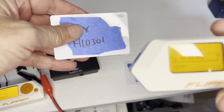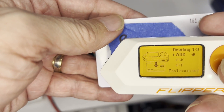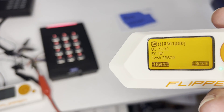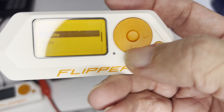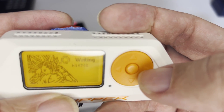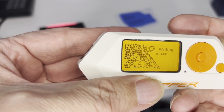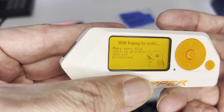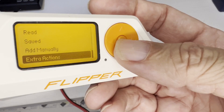Next, I'll use card 29650. We'll read that with our Flipper, and then we'll try to use our Flipper to write it to our T5577. It says make sure the card is writable and not protected. The writable means that the lock bit's not set, and protected means there's no password.